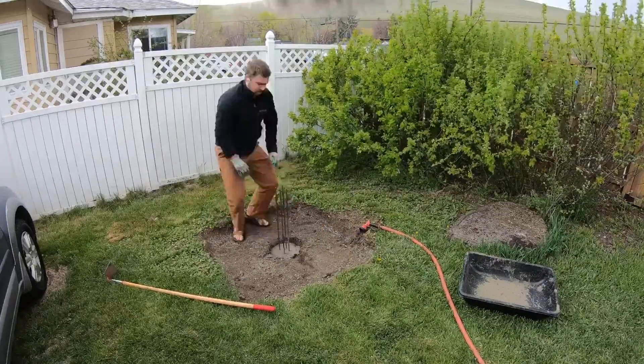You can see it's hailing. I'm leveling out my rebar. One quick thing with concrete: wash everything as soon as you're done, because as soon as it starts to dry it absolutely bonds to everything. Rinse your tools down right away — it's going to dry on that stuff way quicker than it's going to dry in the hole.